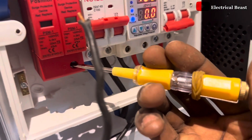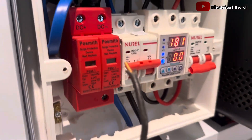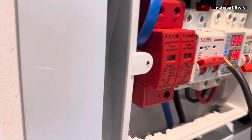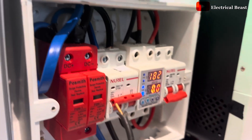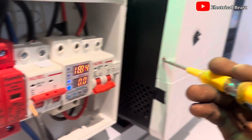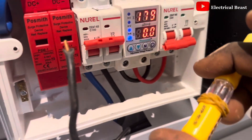When you put your hand there, you get electrocuted. So it's very important for you to earth your inverters when you finish your installation, especially when it comes to high voltage and high frequency inverters — take a separate earthing wire from the inverter's earth terminal to the ground.